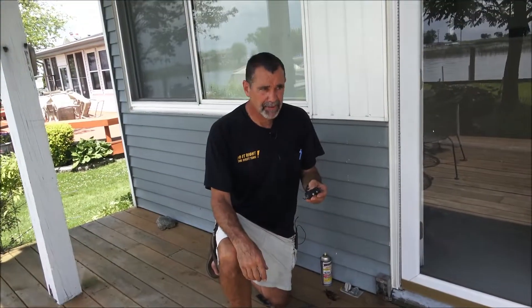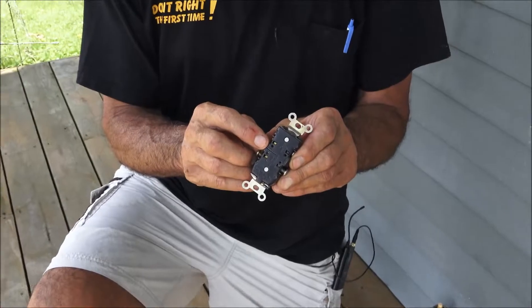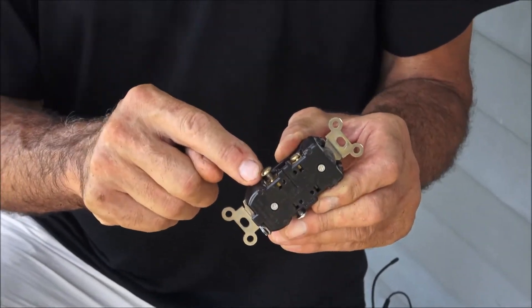When doing electrical wiring around the house, the trick of the day is: don't use speed wiring. Unless you don't like the guy you're working for — eventually these can come loose. Use screws, tighten the screws twice, and you'll have a good job that will last years and years. Quick tip from MrHardware.com.